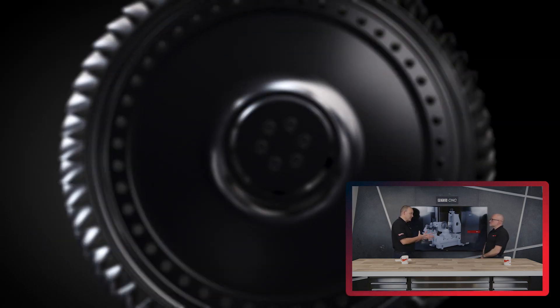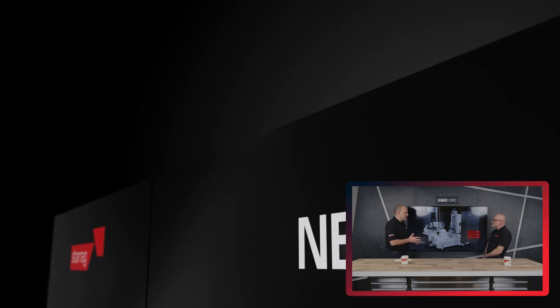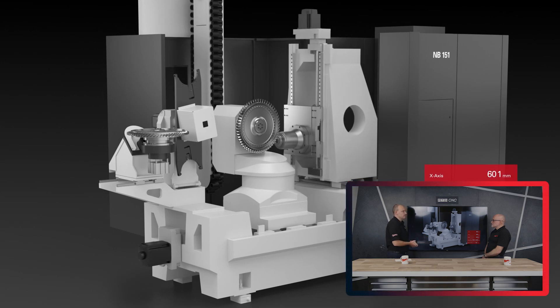So it looks essentially the same as a disc with the blades in. We do have an episode amongst the aerospace sector episodes where we talk specifically about blades. Aero engines still use traditional blade and disc type systems with a series of rows of different sized blades as you go through the engine. You have blisks manufactured from nickel alloy which tend to sit at the back of the engine, and then you have some blisks manufactured from titanium that tend to sit somewhere in the middle of the engine.